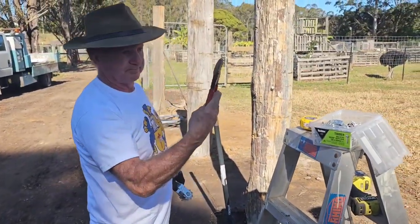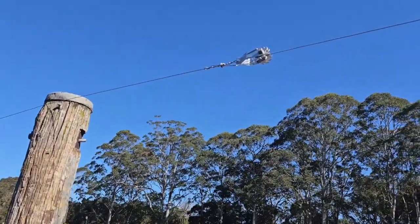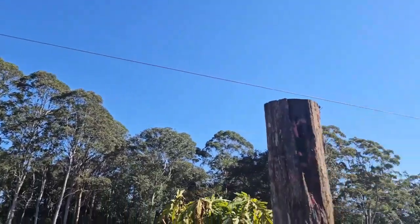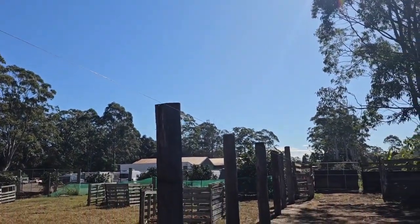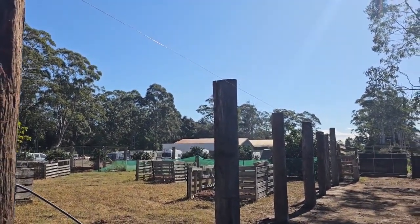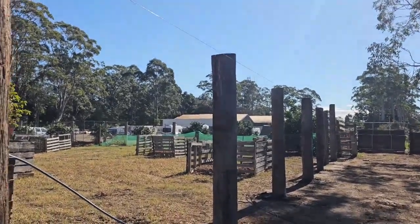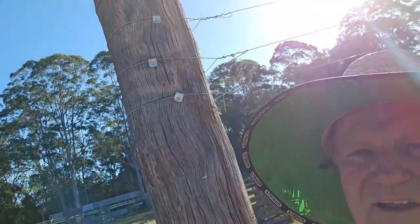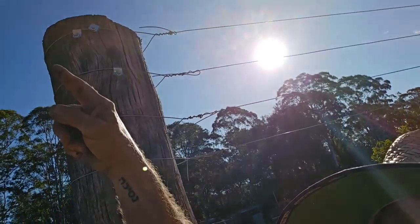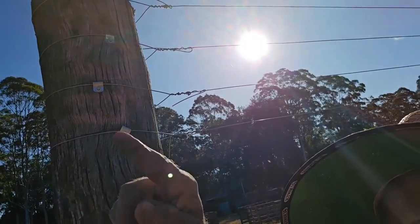Great little tool does everything. There you go - it's on there, right down to over there. If you can imagine, have a little bit of sag - just have a look down the wire, see it sags maybe about an inch in the middle, just lift up the middle to take the straightness out. Look up on the post there - the very top one I wired up and clipped, next one down 160, then 145 and 145.